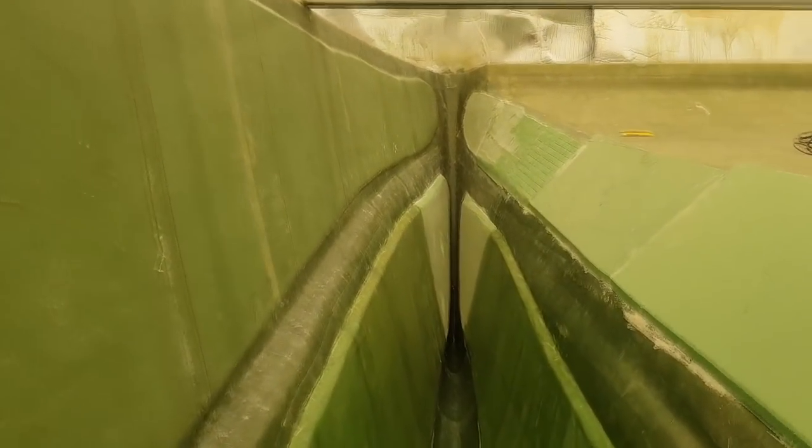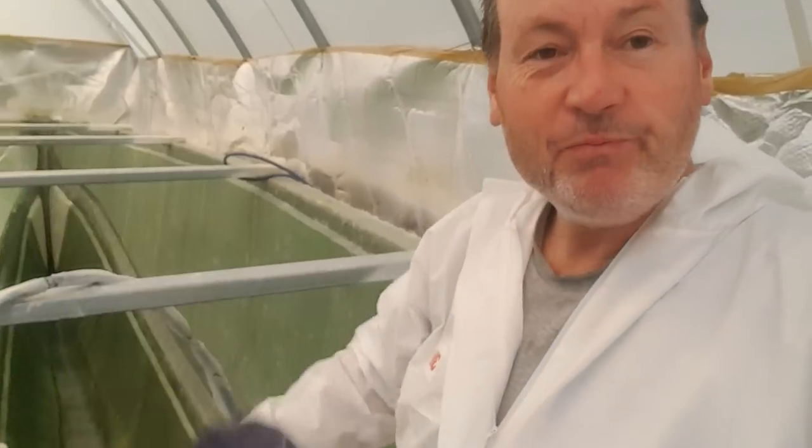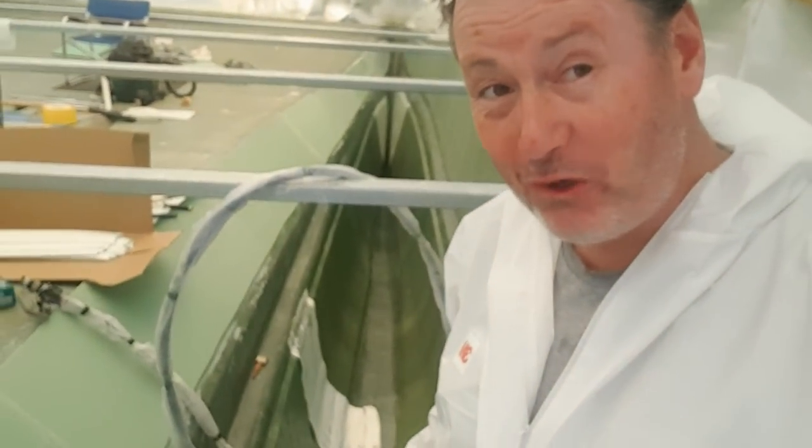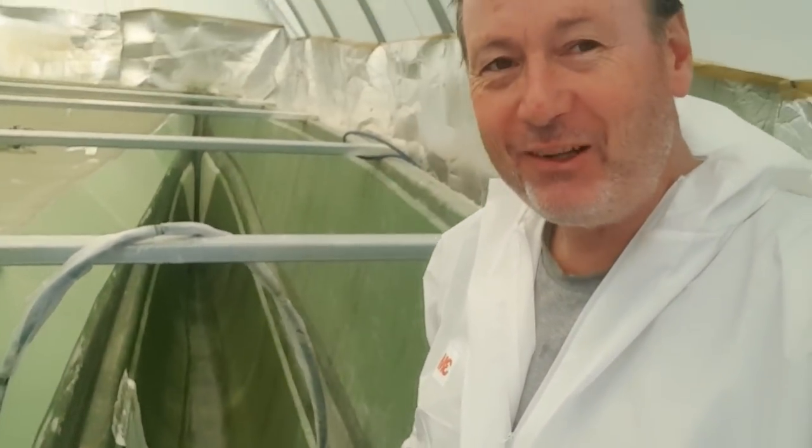making sure to saturate the resin into the slots. I know I've probably said it a few times, but putting this triaxial, biaxial, quadraxial sort of cloth down takes a little bit of patience and a little bit of skill.